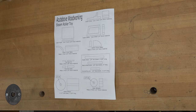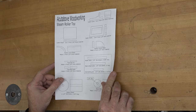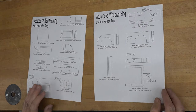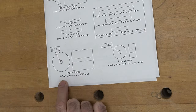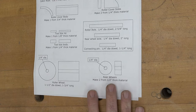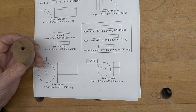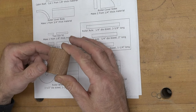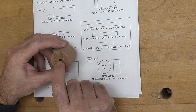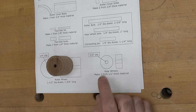The front roller starts with a piece of inch and a half diameter dowel. There are enough pieces in this pattern that it takes up two sheets. I didn't have any dowel so I ended up turning mine out of a scrap chunk of mahogany — it's an inch and a half in diameter, one and three quarter inches long, and I've drilled a quarter inch hole right through the middle to form the roller wheel.